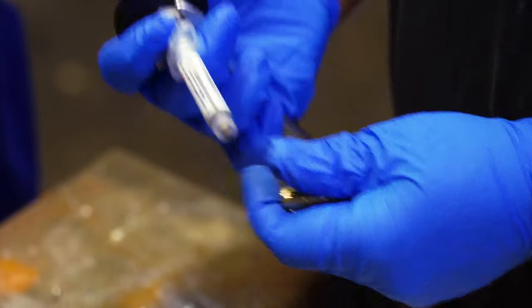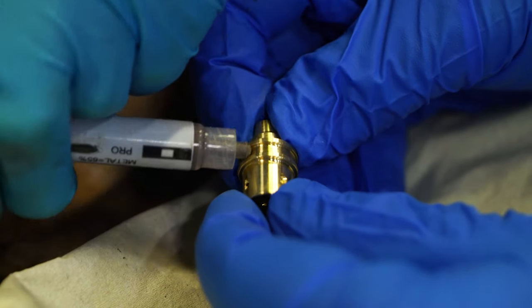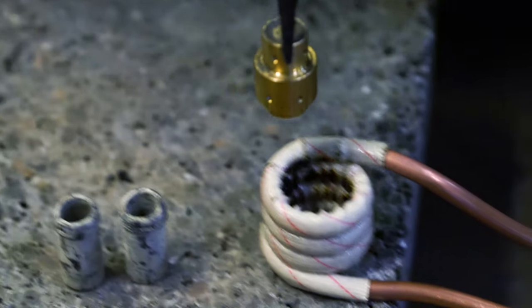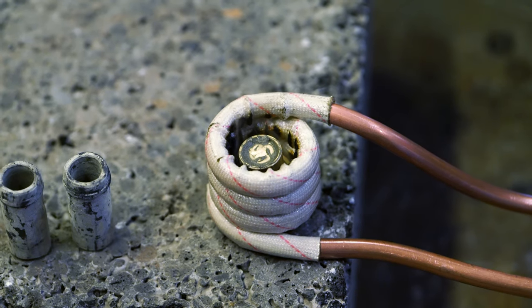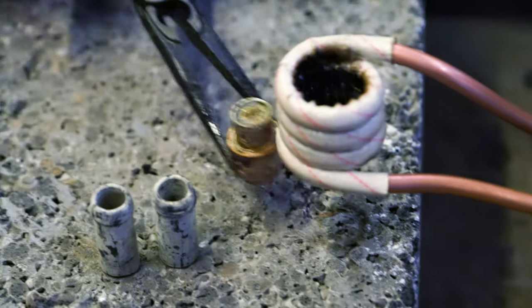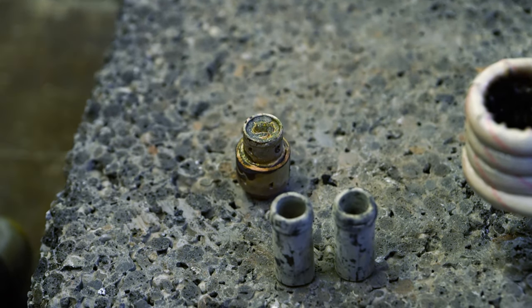We had a little bit of much more fresh silver solder paste left over from some experiments about a year and a half or two years ago. We tried that one instead, and it turns out the induction heater can heat one of these swirl injectors way faster than we need. It seems to work and it's a hassle-free, straightforward process — so induction soldering looks like it might be the way to do it when we're going to do a couple of hundred swirl injectors for the first BPM 100 injector.